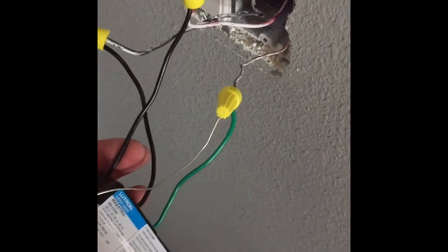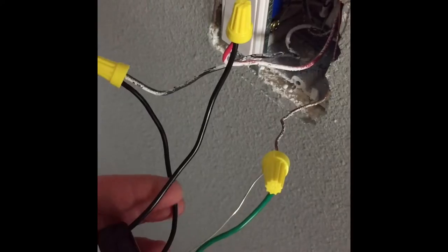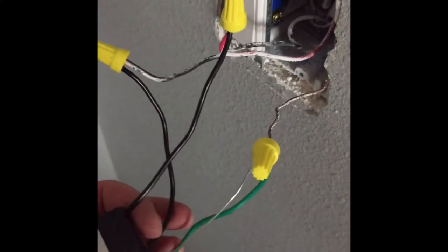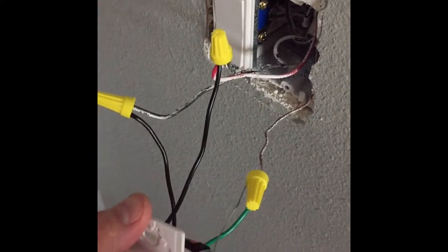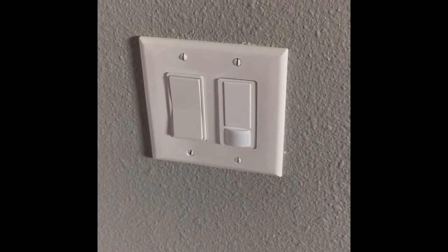Alright, we've got it all wired up. As you can see, we've got our top wire black to red, as red was in the top of the last switch; second wire black to black; and then we have our two grounds tied into the ground that was provided — everything snug, nice and tight with a wire nut. We'll get this put back in the wall and test it out.